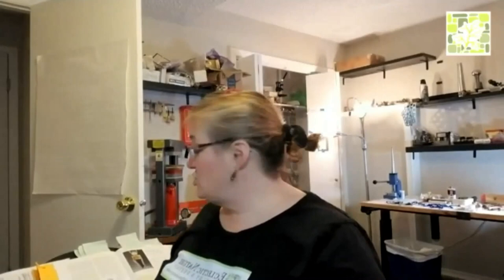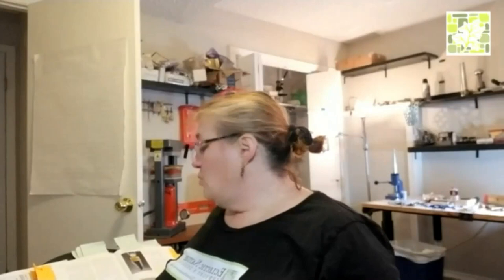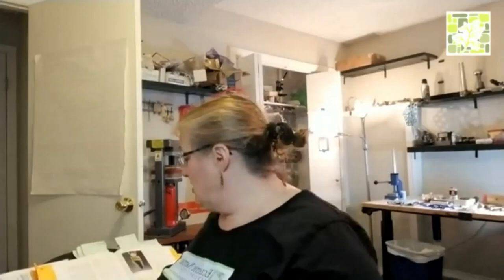Looking at what we're going to do, I want to point out one of the most important things on page 61, in which he encourages us to file down an angle to bevel the inner wall of the inside wall, the one that's going to be touching the outer wall. So you'll see he's done a little blow up image of it at the bottom of 61. And that holds true whether you're doing one of the wire rings or whether you're doing the wall. The reason for that is it gives a little channel for our solder to flow into. If we do not do that step, it puts a lump of solder right where our stone is going to be seated. So that's one of the most important things you can add to your practice.